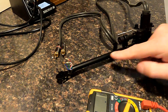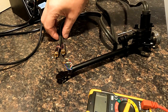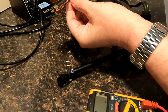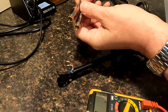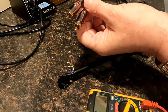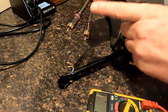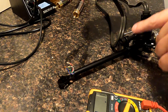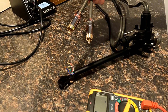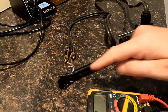The question is whether the break is within the tonearm or within the cable. Quite often with record players it can break just after the plug. I don't think it is here though, because usually what tends to happen is if you manipulate it like this, the channel will come back on and off, crackle and buzz and do all sorts of things. But this isn't doing that — it doesn't seem to make any difference. So I think the fault is somewhere else within the cable — it might have been snagged or something — or it's within the tonearm, which is actually very unusual with Regas. We've established there is a break somewhere between here and here, and we need to find out whether it's in the tonearm or in the cable.